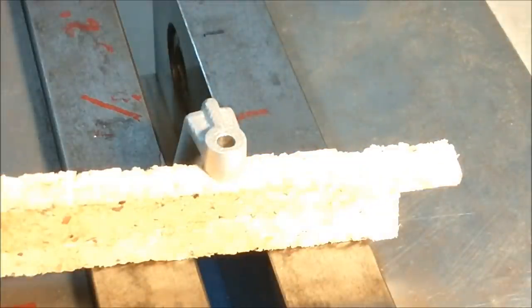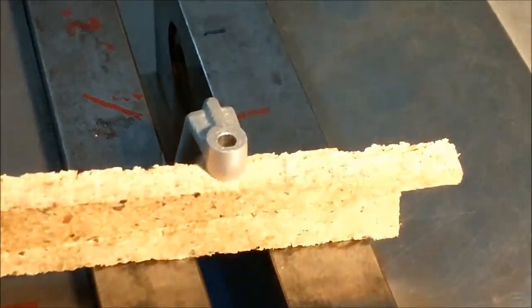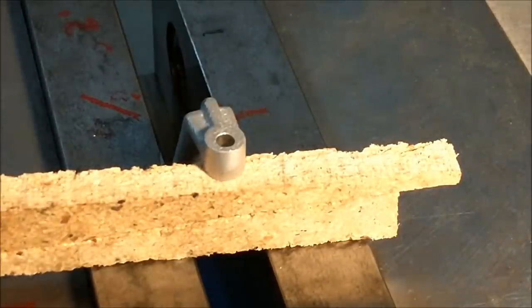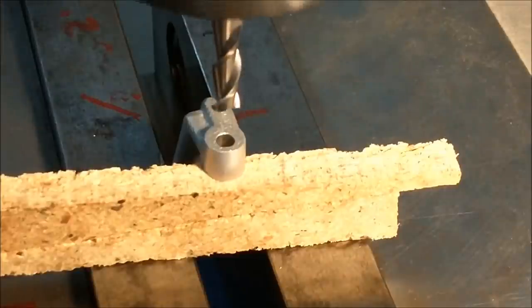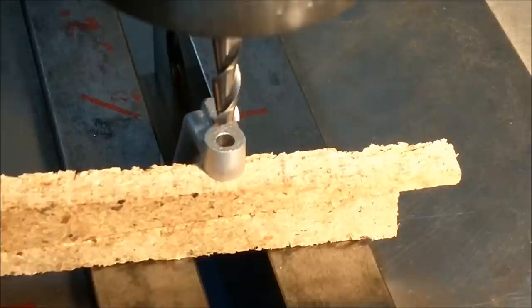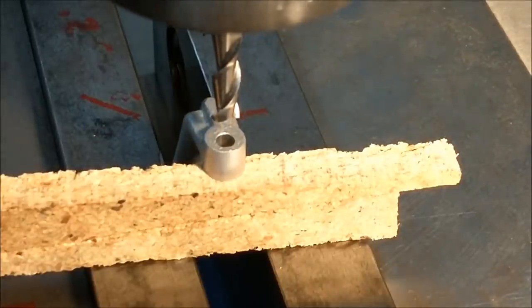Well, that's bright. It's a 3/16 diameter cutter. It is about a millimeter and a half larger, and it's offset about a half a millimeter in both directions to consume the hole. I'm going to pass this down through there. Hopefully this will be relatively on center, but it has to consume that hole, and that's all I'm worried about right now. Any kind of luck, this part won't explode in the next 45 seconds. Here we go.